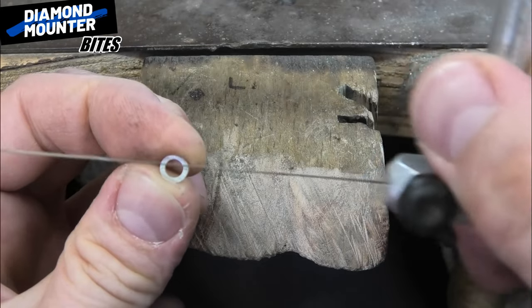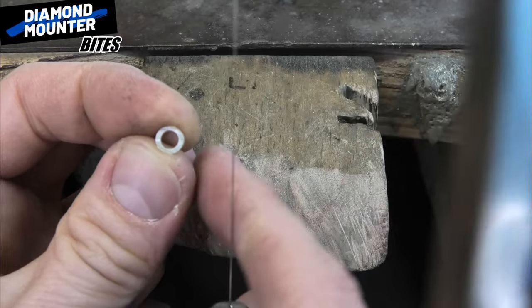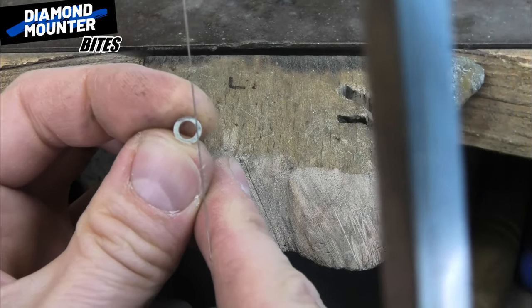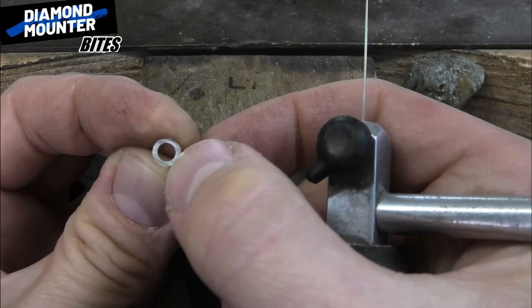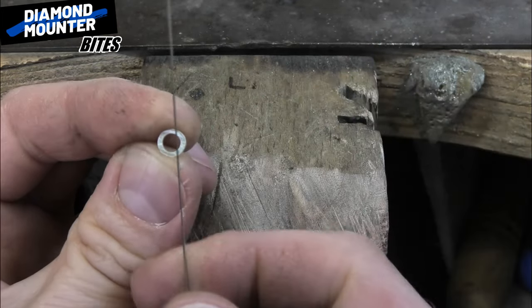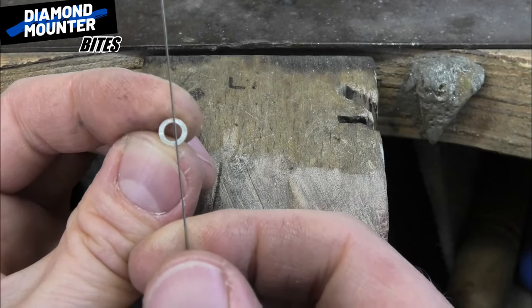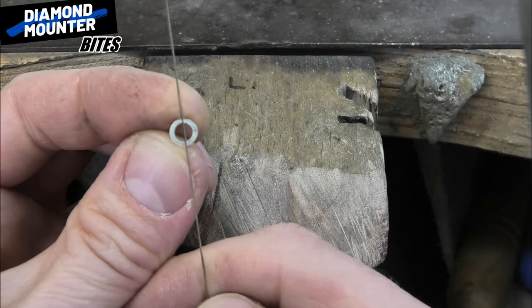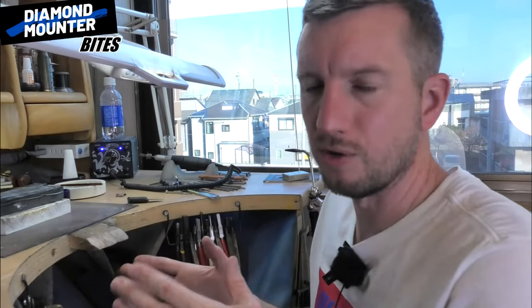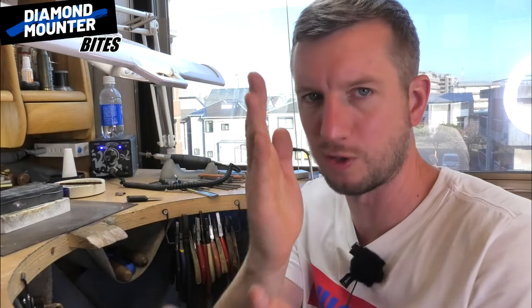Don't try to hold your saw blade in weird positions — you want to work really carefully. Now my marks are horizontal, saw blade vertical going down again, working the same way. The second one is probably easier because you've now got these as a guide. If you trust them, you've got your saw blade down the middle, semicircles either side, and also these quarter-section marks. That gives a little extra help to get the last one correct. But it doesn't end there — even if I gave you one perfectly marked out, it still takes a lot of care and skill to actually transfer it into a cut in the correct position.